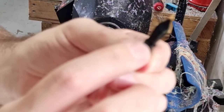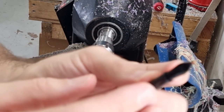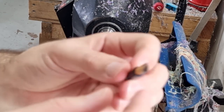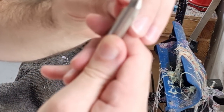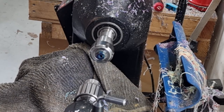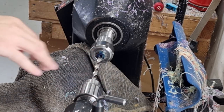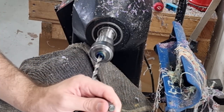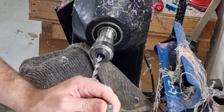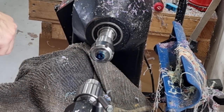The last drill bit we need is for the collar. We just need to drill a tiny little recess for the collar to sit in. The diameter is about 8.7mm, so I find a 23/64th or a 9mm bit works great. You can also use one of your centre bits and stop it at the right size — that leaves a nice curve for it to sit in, and it works well with your live centre later. Just a tiny bit with this one.